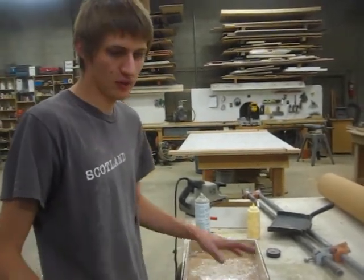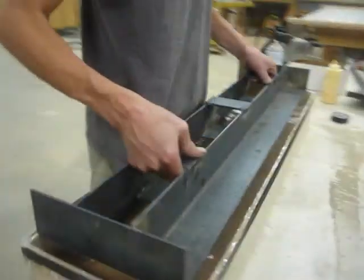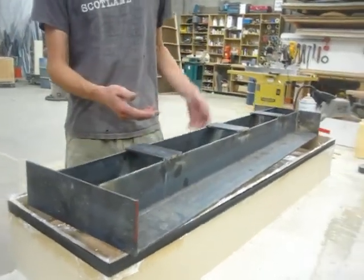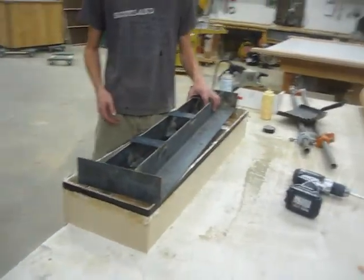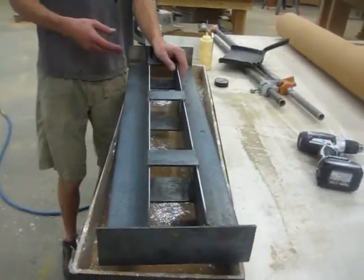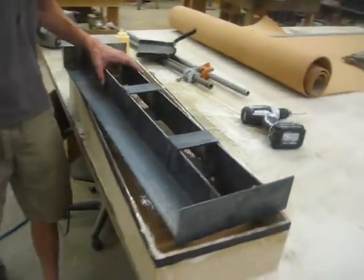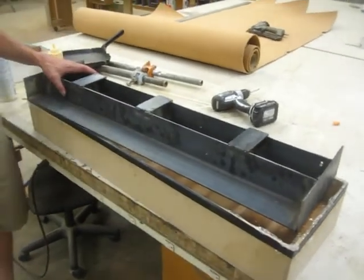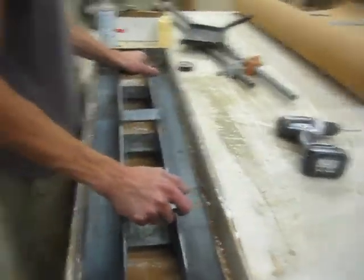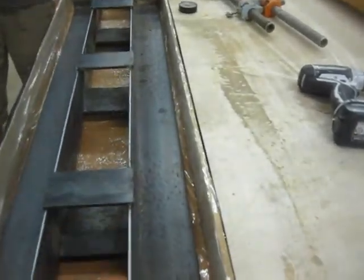When the cement is still drying a little bit, we're going to put this thing on there so it's got a nice contact fit on the cement. This is our — I would call it the mainframe. What it does is distribute the load from our clamps onto the concrete and prevents the concrete from getting point loaded, which will prevent it from cracking. So it provides a rigid surface area to compress the concrete evenly and distribute all the load against the female piece of the press.